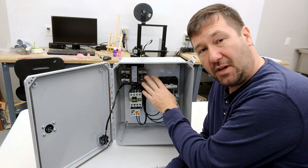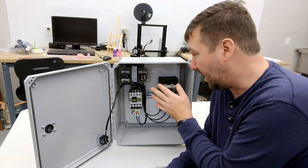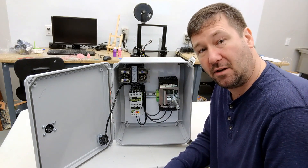The best thing to do if you're not sure if you have your transformer wired right is disconnect the lead from the secondary side, turn the power on, and check it. We'd like to thank our Patreon supporters who made this video possible.